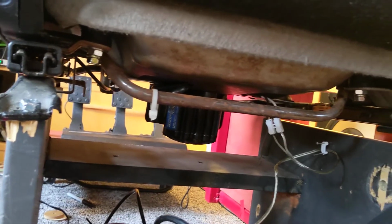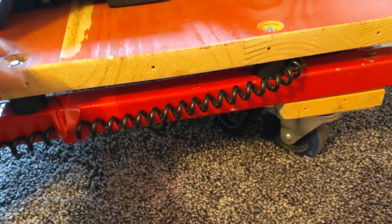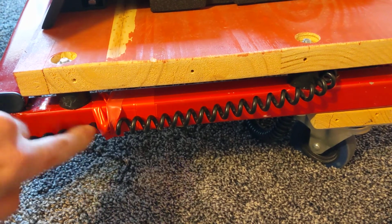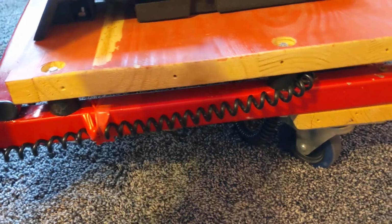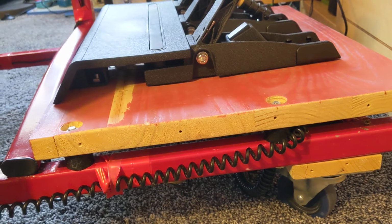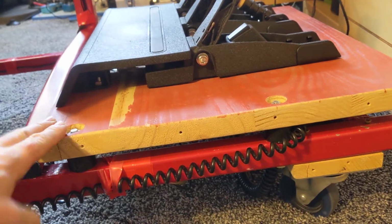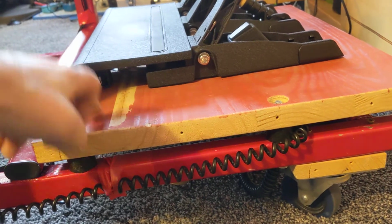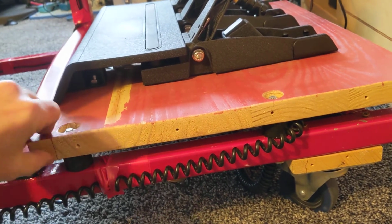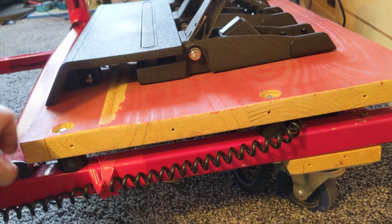How do the isolators work? The best way to describe them is up front, really. Before I put in the same isolators, the isolator is in here, so the wood is attached to the top of the isolator and the frame is attached to the bottom of the isolator. Before I did this, the little transducer on the bottom had to work really hard before it was creating any movement that I could feel, because it had to vibrate the piece of wood, the pedal, the entire frame, the whole thing. Now that it's isolated, this is somewhat floating.